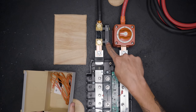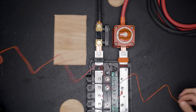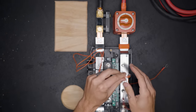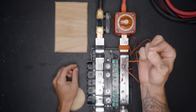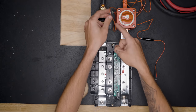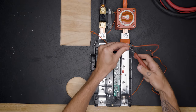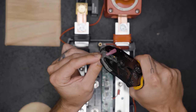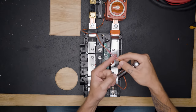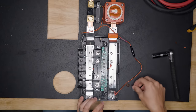Next we can connect the power wire that actually powers the smart shunt. The wire is entirely too long, so we're going to cut out a section of it and splice it together with a butt splice connector. The ferrule side of the power wire is going to go into the battery positive terminal on the smart shunt, then we route our wire over to connect and cut out our slack. With our wire shortened with the butt splice connector, we take this terminal and put it underneath the washer, lock washer, and nut.